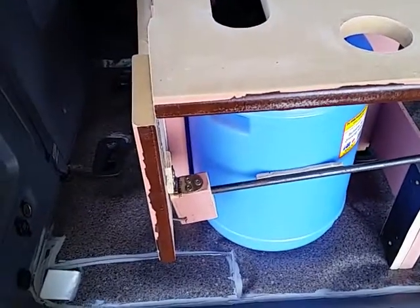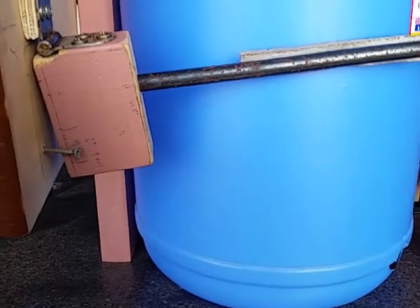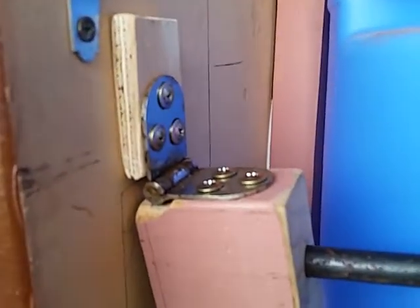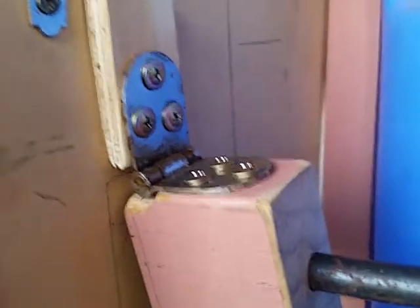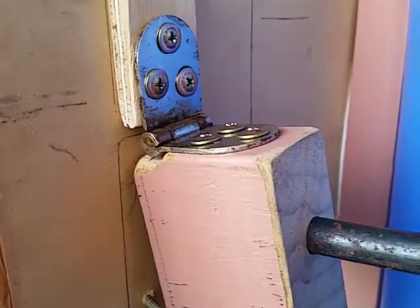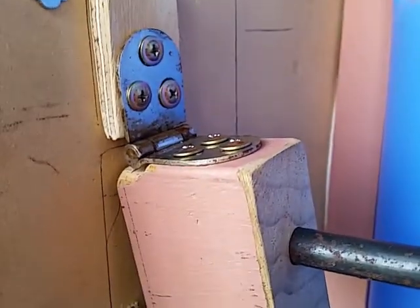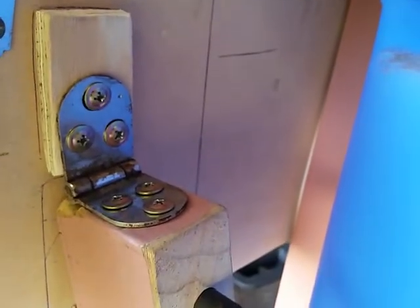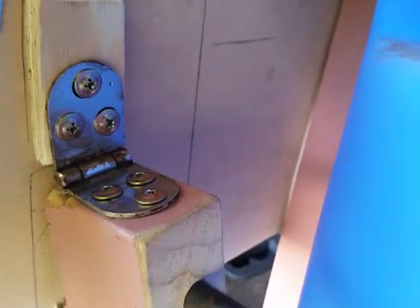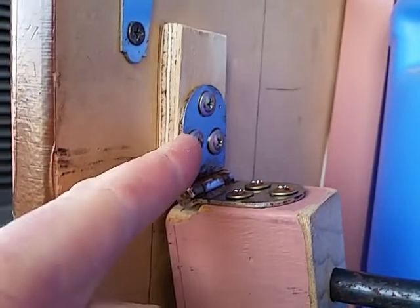This leg has been such a bloody nightmare, it's been unbelievable. It is a lot to do with the fact I have button head screws — almost like your wafer style screw, very similar to wafers actually, just a little bit flatter on the top. And I don't know if you can quite pick it up, but you can see it isn't exactly in line with the original hinge points. The trouble is the hinge is made for bugle head screws and I'm using flat ones.